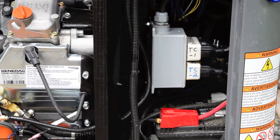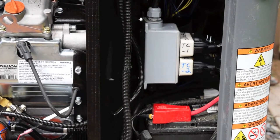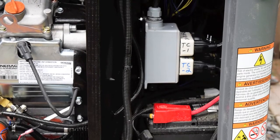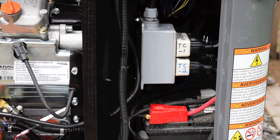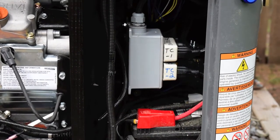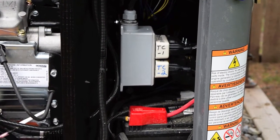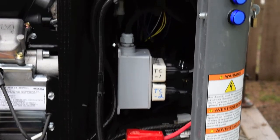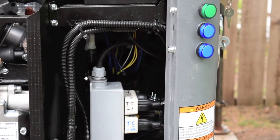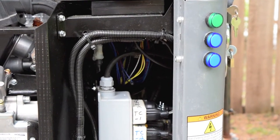The TC1 cube has the second 50-watt block heater. The TC1 cube turns on at minus 18 Celsius or 0 Fahrenheit, and off at minus 12 Celsius or 10 Fahrenheit. Also plugged into that cube is the lower blue light.